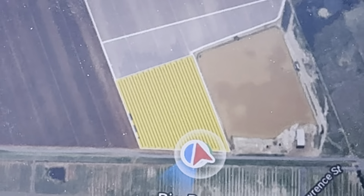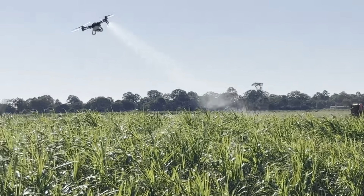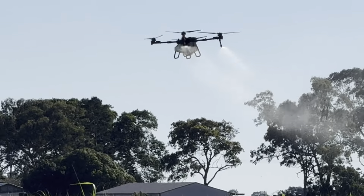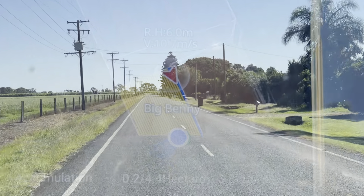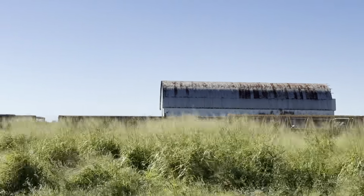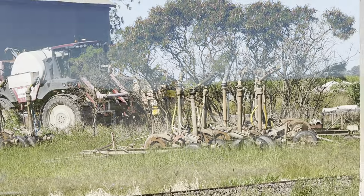As you can see in this footage we are finally up to the last block. That smaller block at the end was five hectares in total. That's the way you have to manage these jobs — they've got to be manageable so you don't spray over the top of yourself. There's no point operating the drone and getting covered in chem; if you're doing that you're not a very good operator. We'd finished that block — it took us roughly four hours to spray the job, about half an hour setting up and half an hour packing up, plus the time it takes to move about.